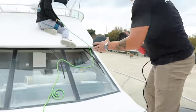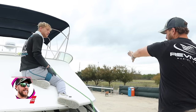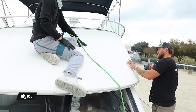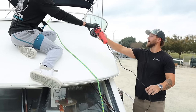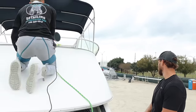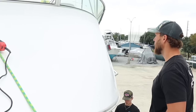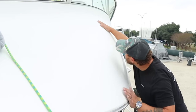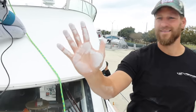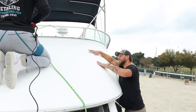This interface pad is a pretty big must when you're sanding. It'll help cushion the sand and flex with the boat's contours. If you don't have an interface pad it won't flex, so you'll get a real big dig on the corners. You can find them online on Amazon or at a paint supply store — just look up 'interface pad.' I typically run between three and three and a half speed. Go ahead and do the whole section — if you feel it, it feels really textured. Look at that oxidation — beautiful.